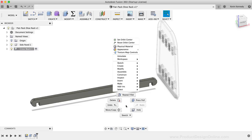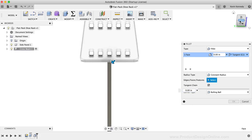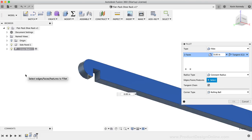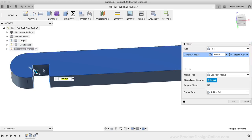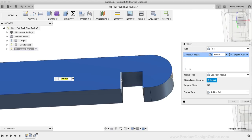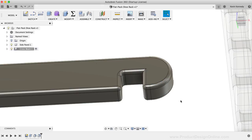I'll right-click and select Repeat Fillet to create a second fillet feature. Fusion 360 doesn't handle filleting all edges in the same feature as the large corner fillets well, so I keep them separate. For this fillet, I'll select both faces of the crossbeam and all four corners of each slot notch, then use the 'bit_size_125' parameter to add a nice one-eighth inch roundover to the entire piece.